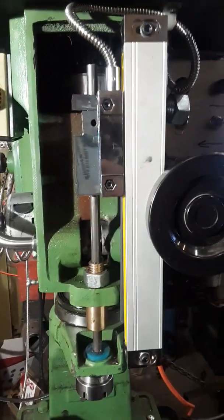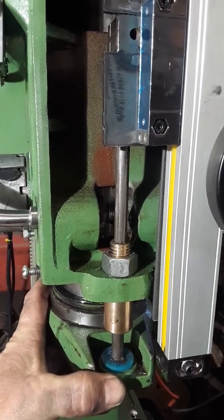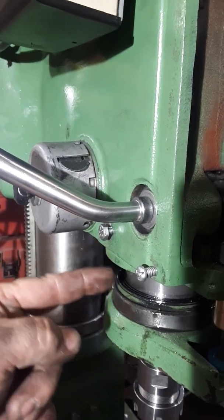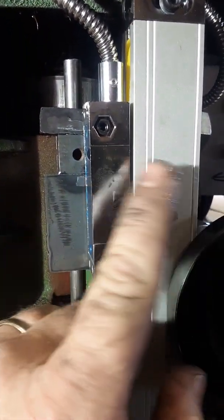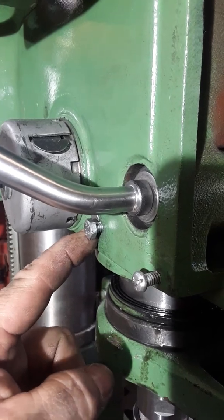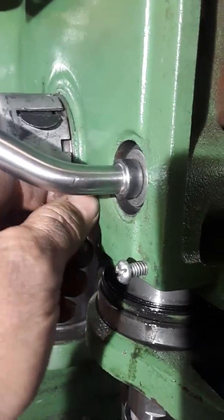The z-axis is probably one of the more challenging pieces to install for the DRO. The first issue was that the quill would rotate back and forth slightly — on a manual milling machine that's no big deal, but for the DRO the relationship between the reader and the encoder cannot change. A bunch of slop causes great issues with accuracy. The original setup had a three-eighths bolt with a three-sixteenths pin engaging in a quarter inch groove in the mill column, with enough slop to allow movement. So I drilled the hole out to a half inch, got a piece of half inch drill rod, milled a quarter inch tang on the end of it, and now it fully engages in the quarter inch groove — that took out 99% of the slop. This little quarter inch bolt acts as a grub screw that holds everything tight.